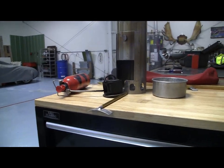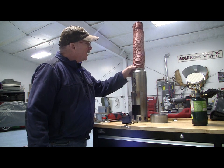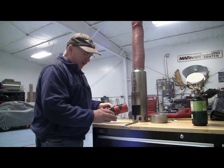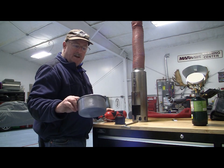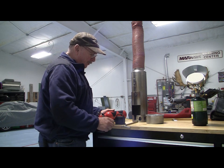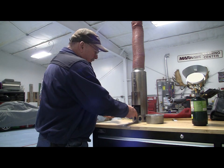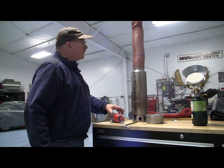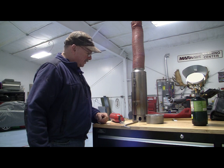I really like it. So the Northern Companion is housed in a stainless steel cylinder, and then you've got a SCAT tubing that would go up underneath the cowl flap. It's comprised of just a standard MSR stove, and it comes with the heating tray for heating water that's part of the kit. So now you have your survival stove as part of your preheat system. You light up the MSR stove, put it in, close it up, and this thing will run for several hours. And so with this up in the cowling, you can easily in 2 hours preheat the engine quite nicely.